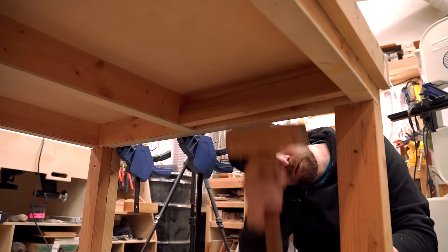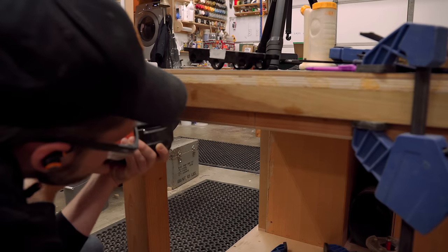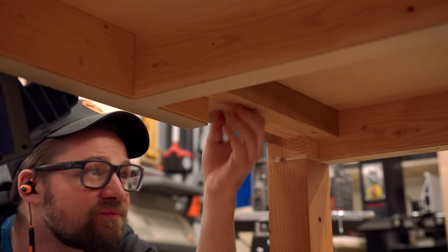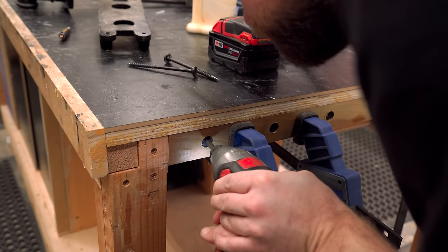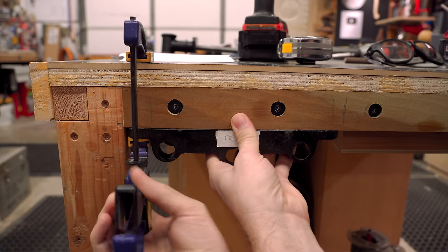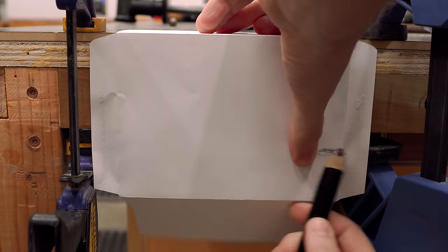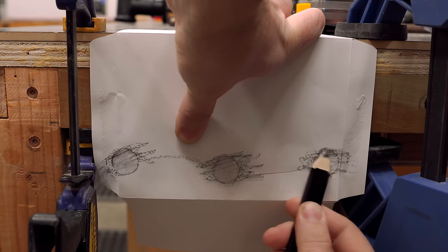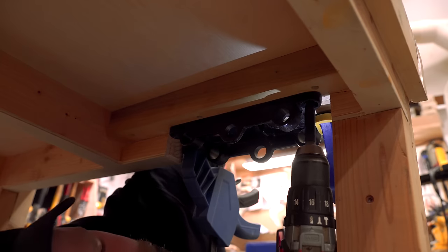To get that edge of the workbench wide enough I glued in a second board behind inside of the cubby, and then I can use both of those as reference faces to cut in and flatten that centerpiece. This was easily accomplished with a multi-tool. The wood glue alone was probably strong enough, but I added a couple of structural screws between the three boards for good measure. I realized the back screw hole was right on the seam between two boards, so I scooted it back a little bit. I set that paper aside, lined up the jaws, pre-drilled the holes, and mounted it with some lag screws.